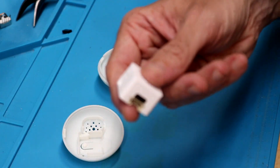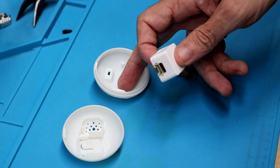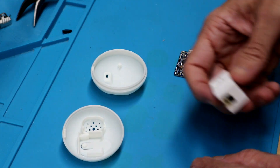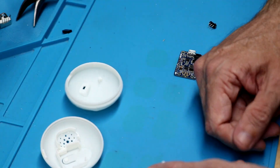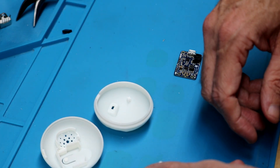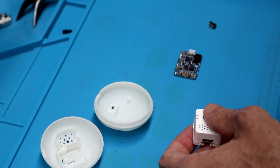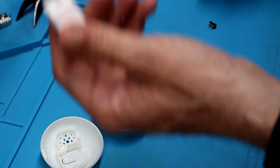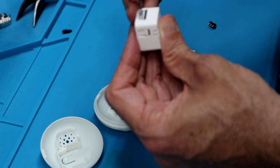When you get the Atom Echo it's going to be in a case like this and it'll have to come out. You can flash it while it's in the case, or after it's soldered in — but you can't flash it once it's fully assembled because you can't get at the USB-C port, only the charging port. I'd go ahead and flash it before you put it together, because it's printed out of SLA resin which is a little brittle, and snapping it open and shut repeatedly will wear out the snap.